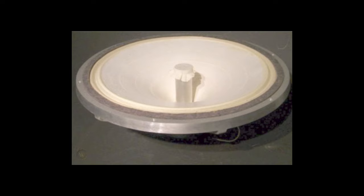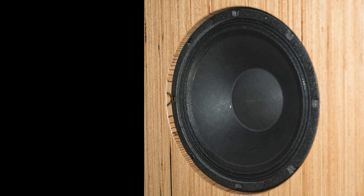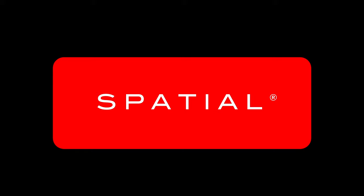Well, remember, you have an open baffle 15-inch — not a 15-inch woofer in a box or in a wall — so there's a lot of differences there. When I walk around shows, I consistently don't like speakers that have small woofers moving a lot. The high-excursion small-diaphragm thing may measure fine and may have attributes like being small, but I don't like the sound of it. It may be the amount of pressure change going on in the box being so rapid because the driver's having to move more — if you made the driver twice as large, it wouldn't be moving as much. And then number two is Doppler distortion.